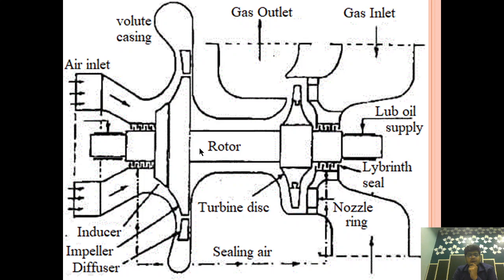After the impeller is taken out, here you are seeing the bearing is here. Okay, the turbocharger I am showing you is a sleeve type. Here the sleeve is there and the thrust collar is there. So we are taking the sleeve out, we are taking the thrust collar out, and after that we are providing a support stay to the rotor. This is the rotor, we are providing a support stay here, and then we are sliding out the rotor from this side.